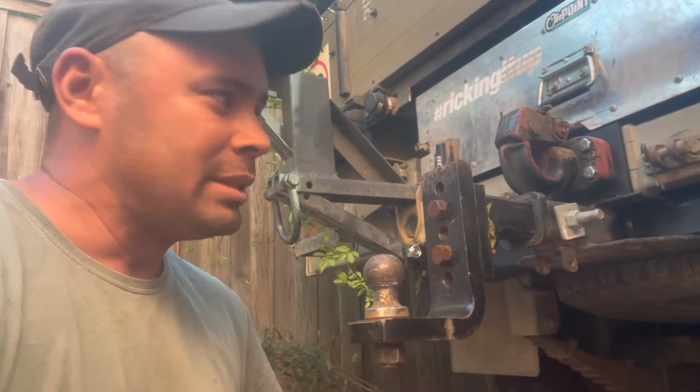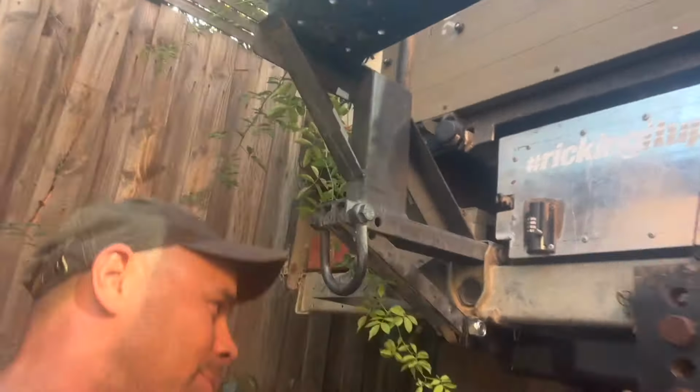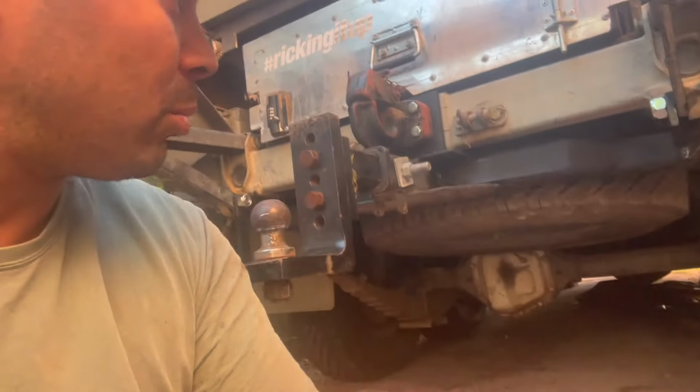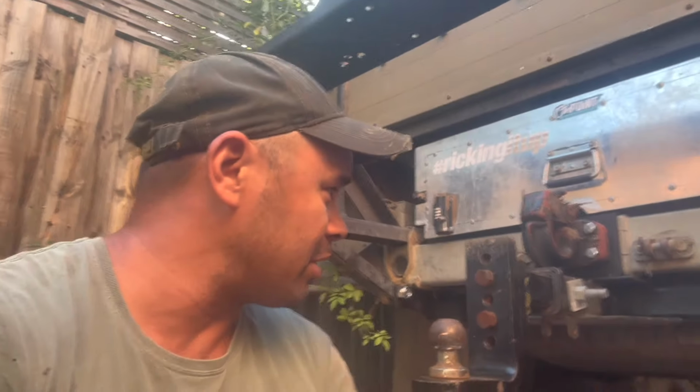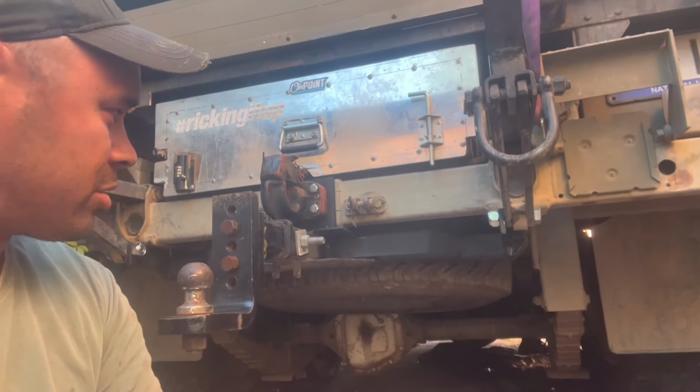And I'm no welder. So I'm actually pretty happy with myself and the welds because, like I said, you've seen the whole process. The structural welds here, they're all triple welded. There's a triple seam on those. And yeah, I'm stoked. Everything just fits perfectly. The spare wheel's back up there. Spare wheel sits up and around those welds nicely. There's 10 high tensile bolts holding this thing together, up, down, north, south, in and out of the chassis rails, and everything sealed in nicely. Even these M20s here on the end, they're as solid as the Rock of Gibraltar.